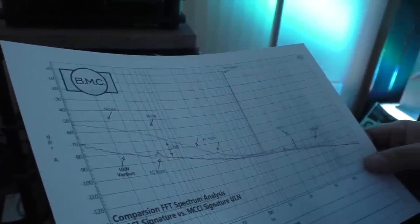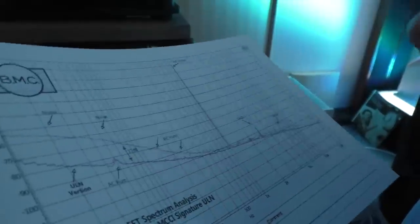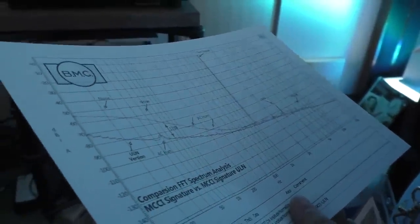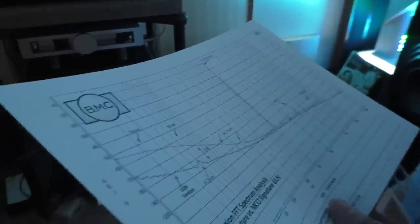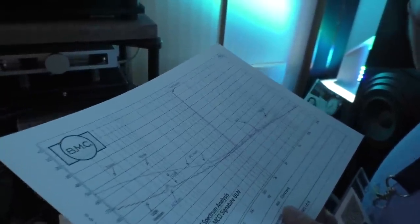So it's very simple actually. This is a totally balanced device. In balanced devices, everything that is differential is considered signal. Everything which is common mode is gone, eliminated. And you don't only have signal paths. For example, in a phono stage, you also need some regulated reference voltages. All of those have a part that makes some kind of random differential noise, and they also have some common mode issues. So the random differential noise cannot be eliminated, normally.